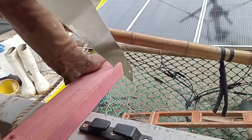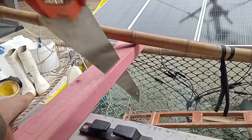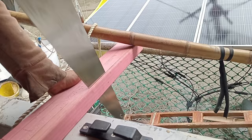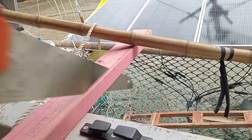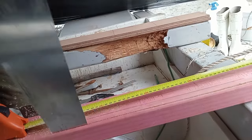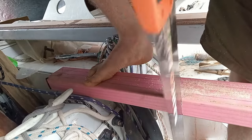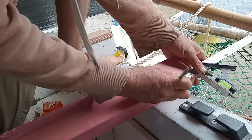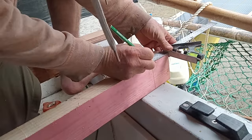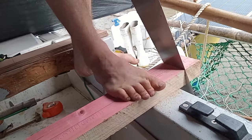These nodes help stop the beam from twisting or collapsing, as well as providing backing for hardware to be attached. I had a 4x2 but it wasn't quite the right size to make the internal blocks. I do actually have a circular saw that I don't use very often — I was considering getting rid of it and only need it for jobs like this, so I wanted to see if I could do it using a hand saw to save clutter. That cut took 8 minutes but it would have taken a couple of minutes to set up the circular saw, so I think this was a win for the hand saw.